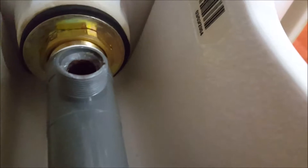Up here in Fresno, California, let me get the camera in there. That's a standard tailpiece for a pop-up drain. Normally what you've got in there is a rod that goes in and then goes up to a pull rod assembly, so you pull that up and down for the stopper. Right now it's wide open, so when you drain water here it's gonna drip out of there.